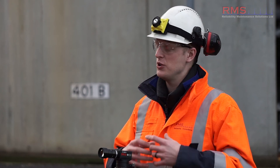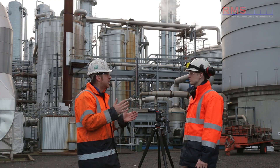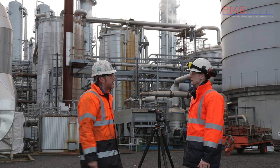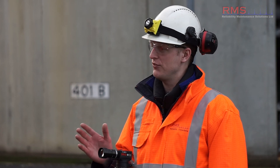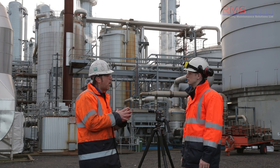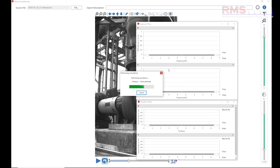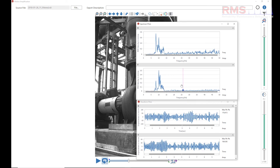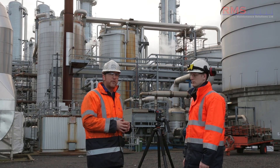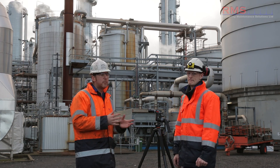You need an engineering background to use the visual side effectively, though a vibration analyst can use both. For frequency ranges, the F-max is currently up to 650 Hz, and it really excels in the lower frequency range from zero upwards. For higher resolution spectra, you simply take a longer reading — most readings are around three to six seconds, but taking longer allows you to split peaks and get finer frequency resolution.